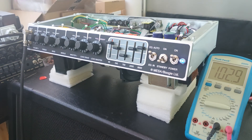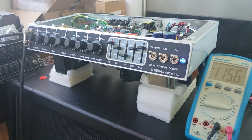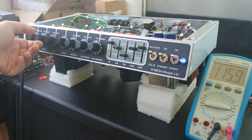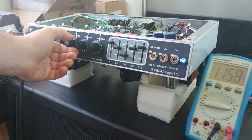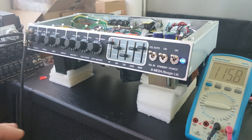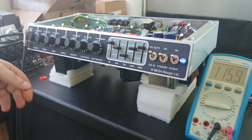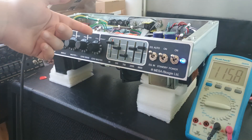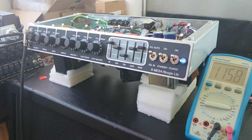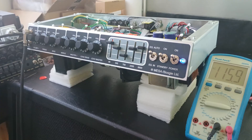We get to 90 volts, 100, then 115 — let's keep it at that. So my master is at zero now. Let's take it off standby. Now with Paul's settings, we should be getting oscillation right about now. But no — you can hear some noise coming from the cab, this is a 4x12 cab, but no oscillation. Let's max everything out: the treble is pulled, the bass is pulled, the deep is pulled, we're on the lead with the pull bright. No oscillation whatsoever.